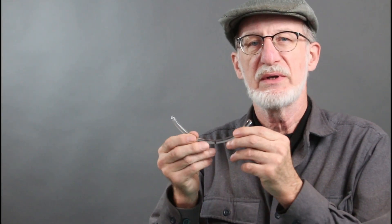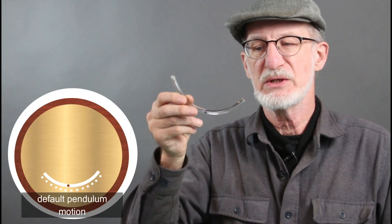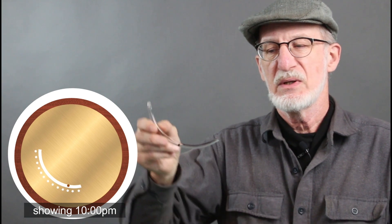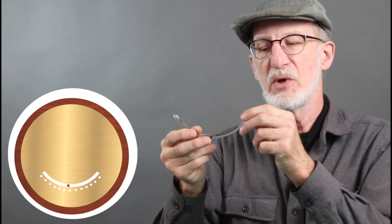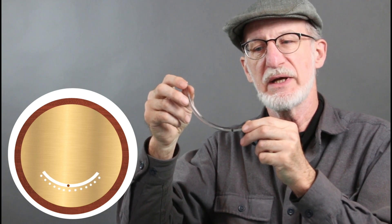I've taken this one apart and found that inside is a little glass tube with a little ball in it. It's a brass ball in a glass tube filled with oil, so it slows down the movement so it doesn't move too quickly. We're going to mount this inside a clock so that it will turn on its center of axis and move so that the ball will point at a series of dots indicating where the time is. If it's all the way over here it might be 1 a.m., and all the way over here it might be 11 p.m. We'll figure out little markings for that eventually.